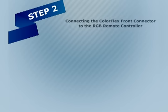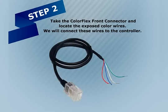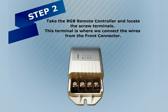Step 2. Connecting the ColorFlex front connector to the RGB remote controller. Take the ColorFlex front connector and locate the exposed color wires. We will connect these wires to the controller. Take the RGB remote controller and locate the screw terminals. This terminal is where we will connect the wires from the front connector.